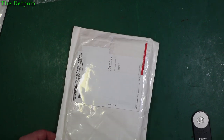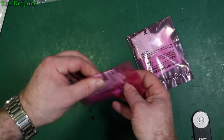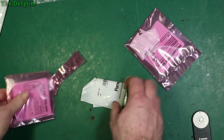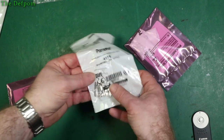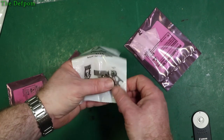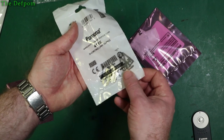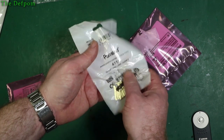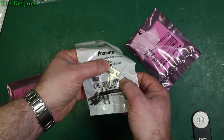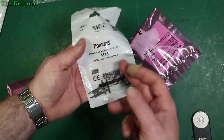This might be another Element 14 bag — these are probably other parts I was looking for. Shorting bar binding posts — the plain shorting bars. I purchased these for a bit of gear I've got that didn't actually have any shorting links. They're not actually that easy to find — took a bit of searching. Pomona 4115, so uninsulated shorting bar links. You can put those over a binding post — they've got an undercut so they won't fall off, and they link two binding posts together using the standard 19mm spacing.